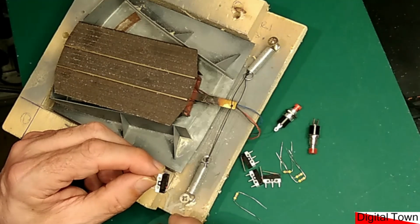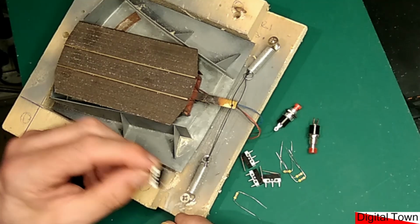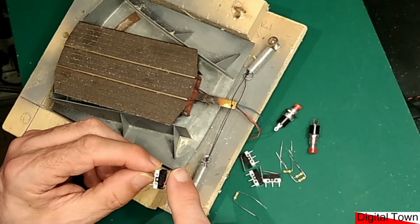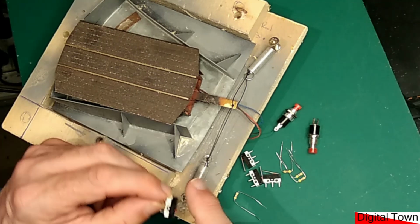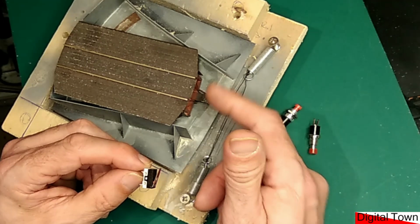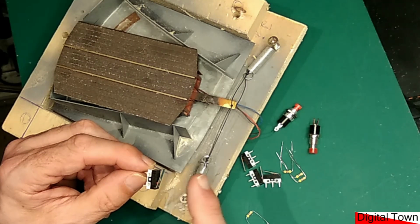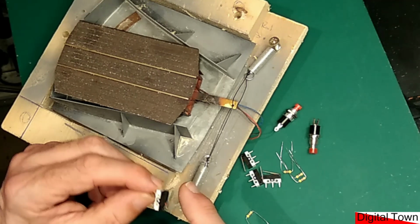Let's imagine now that we break the wire and all of a sudden the line has now gone low because the wire broke, not because the switch was pressed. So at that point our system is going to start turning and we have absolutely no way of stopping the item. Now that is an example.